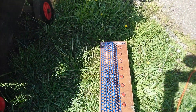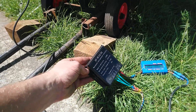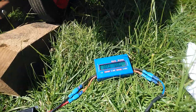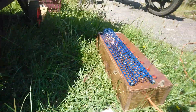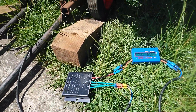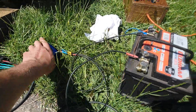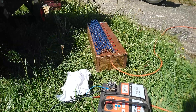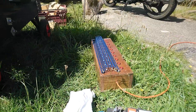What's happened is I've just blown the first set of bulbs. The problem is I think this charge controller is meant to be connected directly to a battery — having it directly like this, it's not seeing any voltage, so I think it actually over-voltaged the lights and blown them. I'm going to stop it and put the battery back in line. It will still work because the lights will take the load out of the battery, which will in turn load onto the voltage regulator. So we've got the battery back in line now — the watt meter feeds straight into the battery and then the array of lights is connected to the battery and we can turn those on independently.